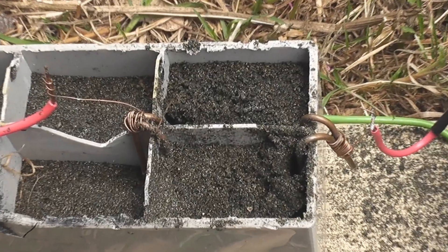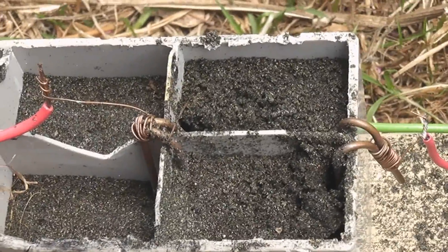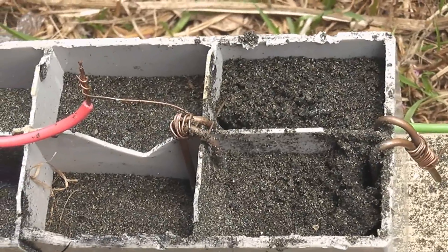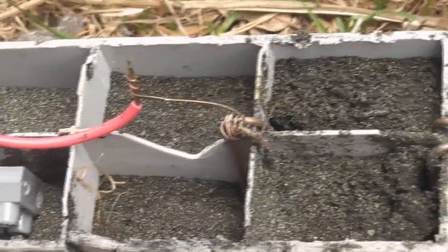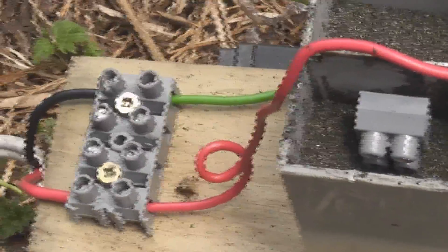So to get back to the sand ballast: I use some iron sand in here. Dry, it's about a mega ohm. Put a bit of salt water or soapy water in there and it's down to about 10k, 5k, whatever. I use one cell with two segments in parallel. But you can use parallel series arrangements. You've got six reservoirs in this one here and then straight out HV out.